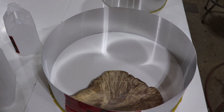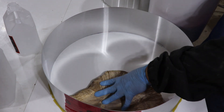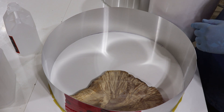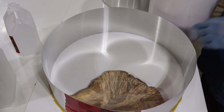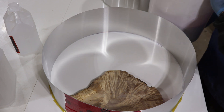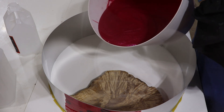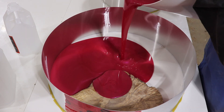So what this is — it's a piece of birch burl. This is the last piece I had. I had a slab which I cut up into three pieces, one for each tray. This is going to be the bottom tray — hopefully 20 inch finished diameter. Beside it is a 14 and a half inch, and then the top one where the cake actually goes will be 9 inches, separated by about a 5 inch pedestal. I'm going to pour this in — it's only 7/8 of an inch to the top of the wood. I'm very hopeful this will fill all three, though I'm skeptical because it's a lot of resin.